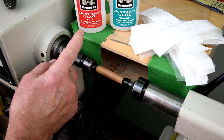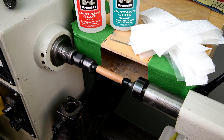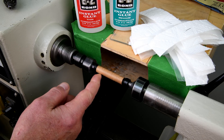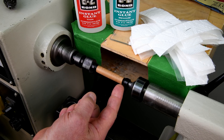I'll start out with thin — give it maybe five coats of thin — and I'm getting kind of low on thin, but medium I've got almost a new bottle, so I'm going to switch to medium and I also want to see how well the medium will go on. Another thing I'm doing differently from yesterday is I'm only turning at about 350 RPM right now. I think I was turning a little bit too fast yesterday, and possibly the centrifugal force was causing the CA glue to build up a little bit more unevenly.